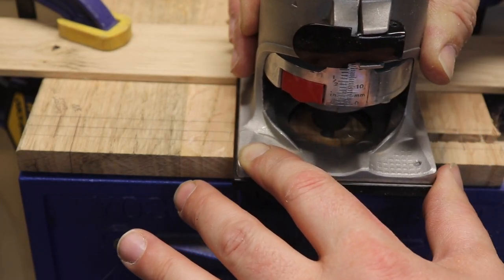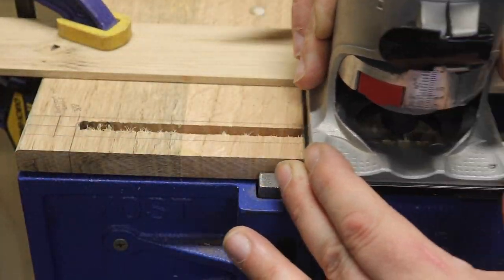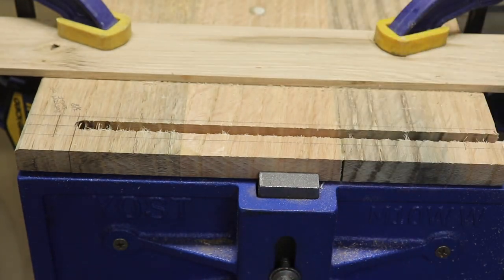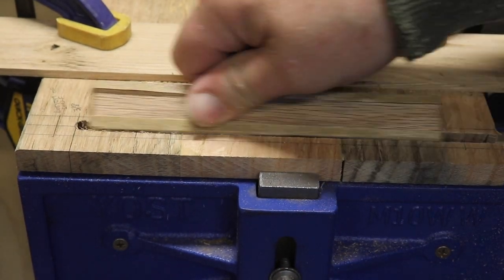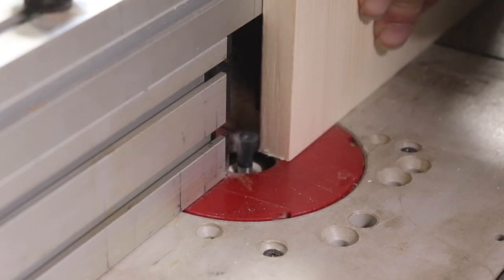The drawer front was too thin to do rabbeted half-blind dovetails, and I didn't want a false face, but I did want a strong joint that would last, so I settled on stop sliding dovetails. These should hold up to many years of opening and shutting this drawer.